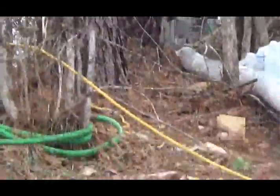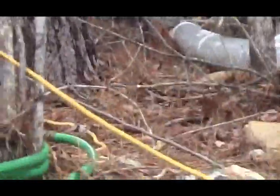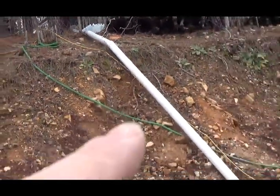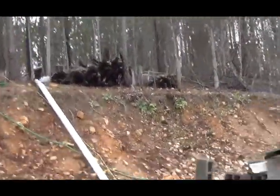opening up his burrow. So I need to trench out still. We got the 4-inch kind of where it's gonna be, just above ground instead of below ground. And inside the 4-inch, I got my water line. So it's going from up at the shack down to the vault. At the vault it turns into the PEX. Goes across, blah blah blah.